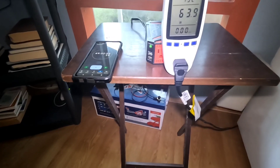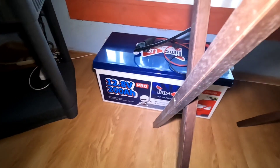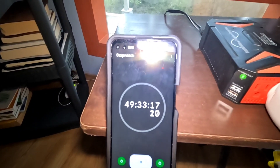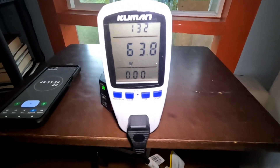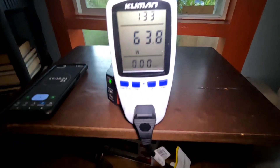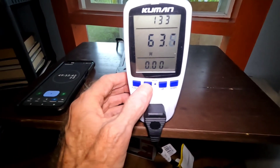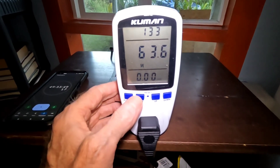We've been running the Time USB 200 amp-hour lithium iron phosphate battery. We put that in right after the OgreeFee test and it has been going now for 49 hours and 33 minutes. The refrigerator is on right now pulling 63-64 watts. Because I don't have a shunt on that battery, I don't get an extremely accurate read on the watt-hours drained, but I'm going to show you anyway and do a little comparison just between those two batteries.